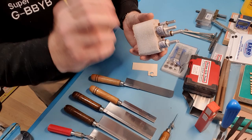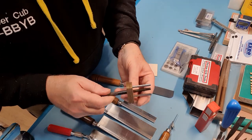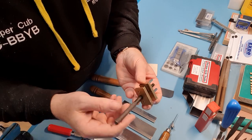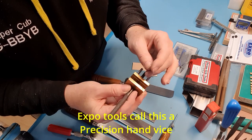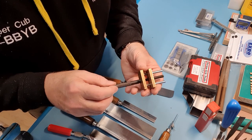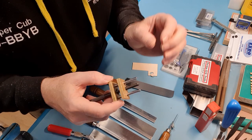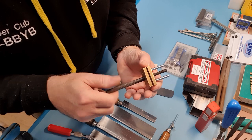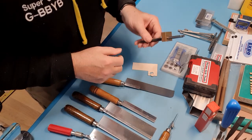Nearly at the end. This is a very nice little clamp — not sure what the name of it is — but it lets you clamp small pieces of litho plate, piano wire, or other small metal parts like control horns, and then needle file them. It's usually for really tiny bits and pieces you're making — you put the part in, clamp it up, and away you go.